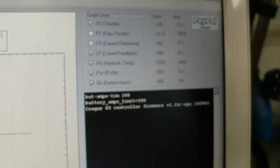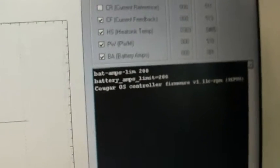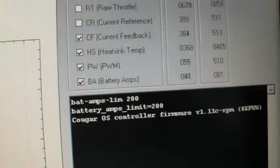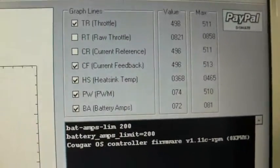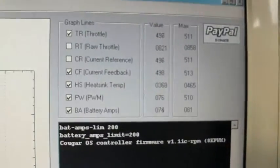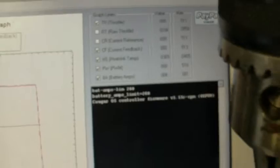And we'll try and get back over here now for some heatsink action. So there's our data, loads of throttle applications, and 32 centigrade. And PWM, because I would have been messing with that when the 12 volt was turned off, just to see how high the PWM goes with full throttle. And it's only going to maybe 72. That's full throttle there now. Looks like 32 degrees seems to be where everything is reaching a thermal balance here.